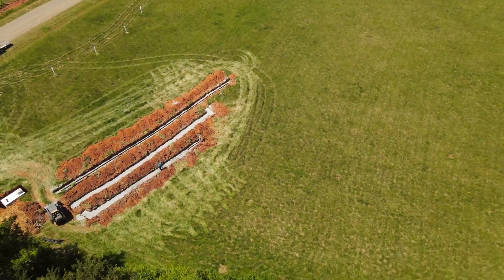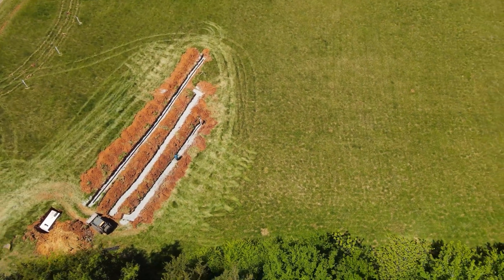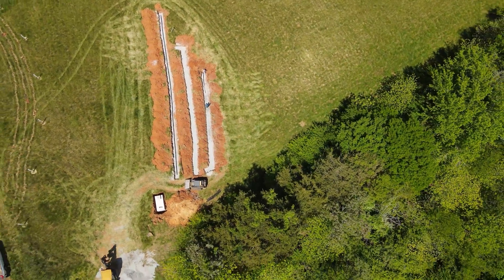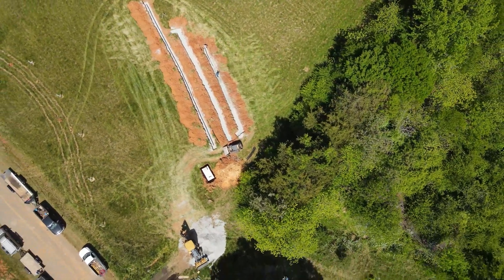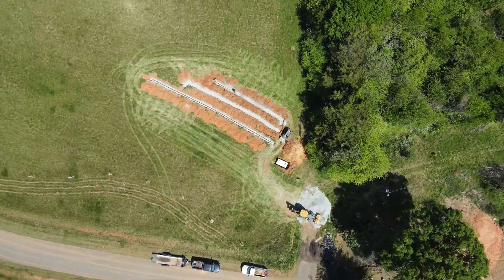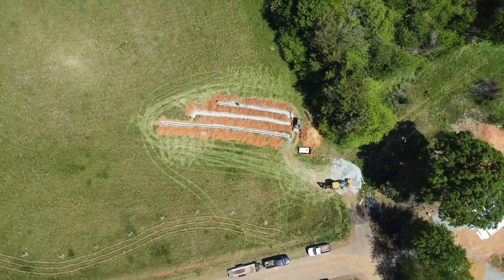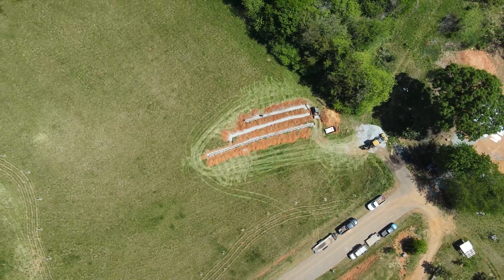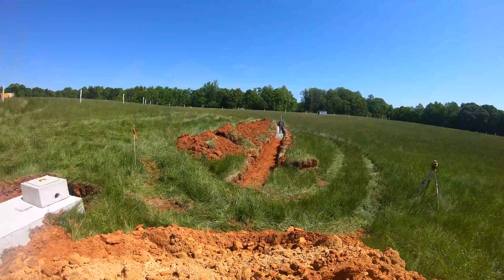The alternative systems are either plastic dome or basically styrofoam peanuts, and if the field gets muddy a horse or a cow can step in it and maybe penetrate it. The gravel is more labor-intensive because you have to use two pieces of equipment and a little bit more labor, but it's worth it when you have to run equipment over it.